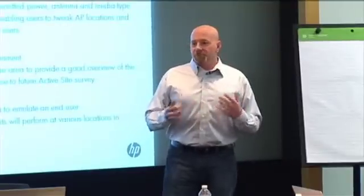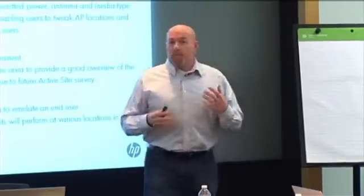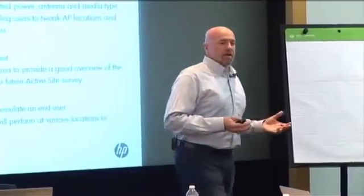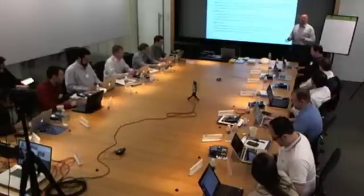And what we're seeing a lot in trending out at the larger companies is they're swapping out their 802.11 a/g access points for what today? 802.11n. Now what they haven't done is another site survey, right? So all of a sudden, where they had coverage, they don't have coverage anymore. Or where they didn't have coverage outside the building, now they have coverage because of the reflectivity and other things in wireless.